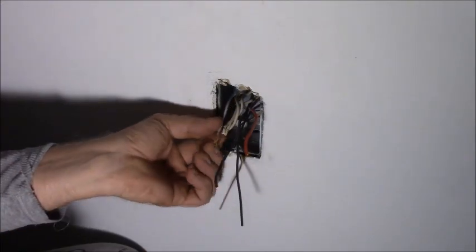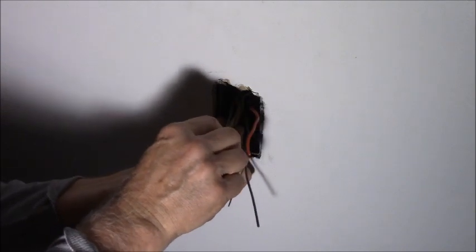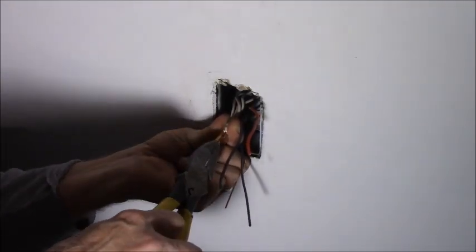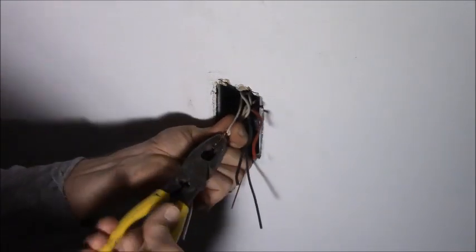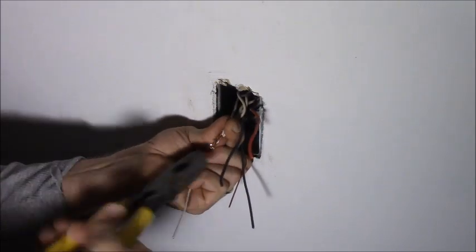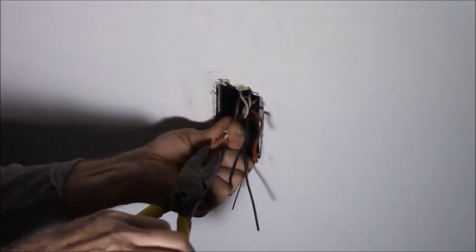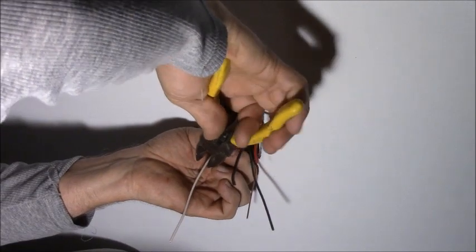And where you cut those wires with your dikes or your pliers, they're very sharp, so have fun with that. I'm sure you will. Again, we're going to push them back so the tips are even, because we want all the tips of the wires to be caught into the wire nut, see? That's the main reason for that. All right, okay. Perfect spiral.